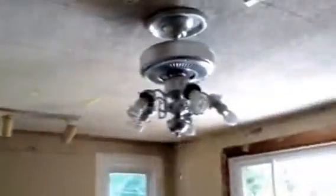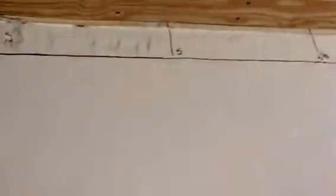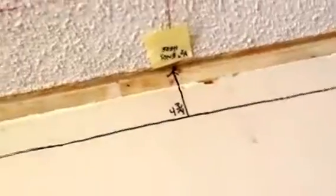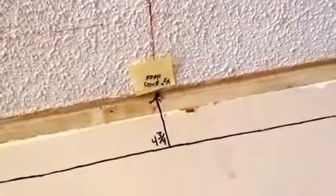You'll notice I drew a line where the laser hits all the way around because this room tends to be bright. I also marked where the studs were at the top of the ceiling. I went around with screws and marked where the studs were, and also marked the depth of those studs. I found my lowest point, which here was 4 and 3/4 inches — and that becomes important later.